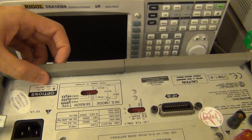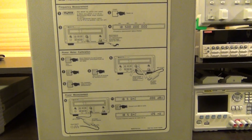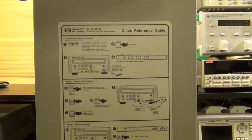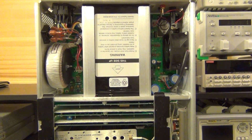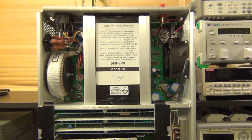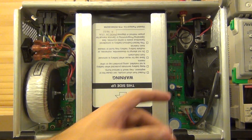So let's go ahead and remove that screw and take a look. It's the easiest thing to take apart. There we go — look at that. There is a lot of stuff in this. Right off the bat, here's our battery — better take this out. This thing must be really, really old. Starting from here: here's our fan. At the back I can see some electrolytic capacitors — they look to be in reasonable shape. There's a transistor up there, or a regulator, most likely used to regulate the DC input signal. Remember, the DC can go from 12 to 26 volts, so something has to be internally regulating it.